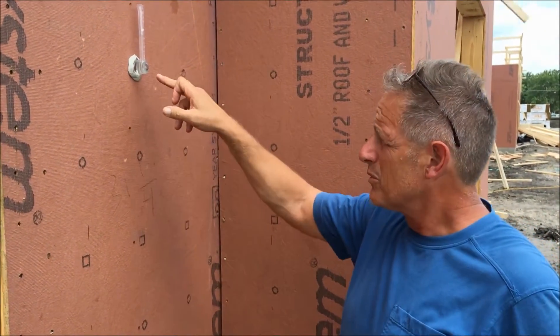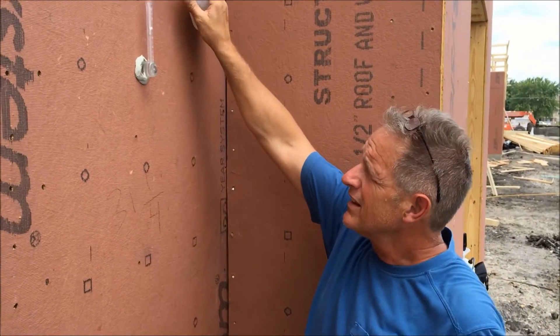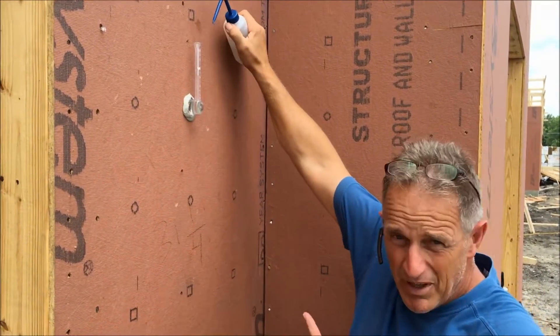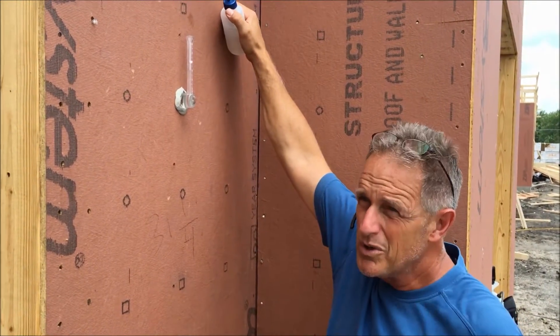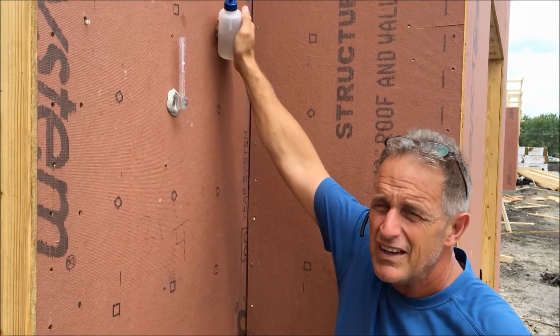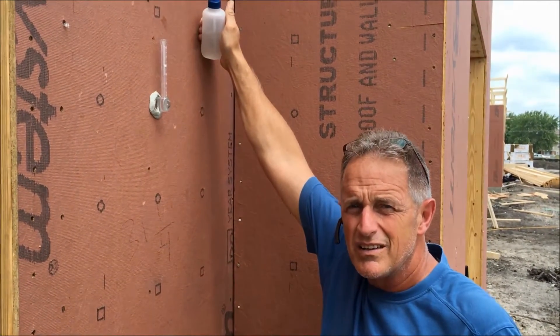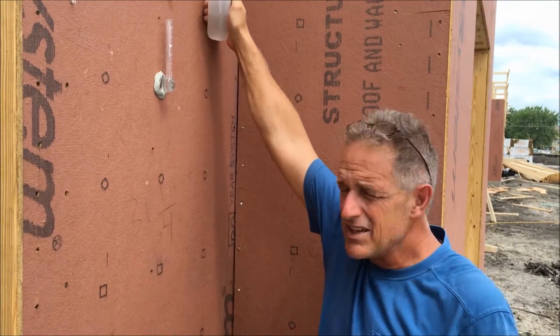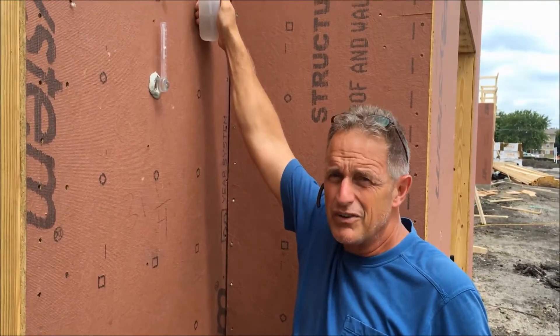With a leak — we're showing right here. Now granted, not as much water will get behind the siding as what I'm applying here, but the water will get there over time. It's going to go in and follow that nail — that is a direct path of water to the interstitial wall cavity. There'll be insulation put in here.